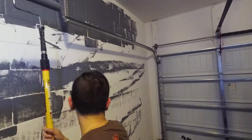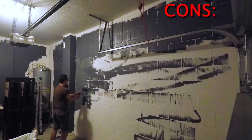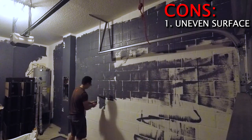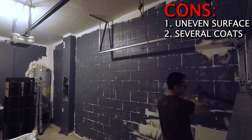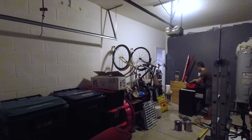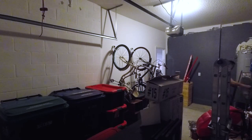This is the part where I figured out that depending on the surface you're dealing with, it's not always a good idea to use a paint roller. If your surface is not flat you'll have uneven coverage — just like the cinder block wall — and because of that it requires more coats of paint, which drives up the cost. Also, because of the little pinholes and crevices, it took a lot more effort to get those covered up. The one thing I learned throughout this process is how important prep work is, and to give yourself enough time to move things around to create an area to work with.